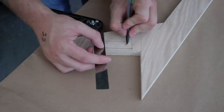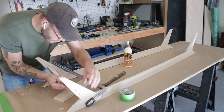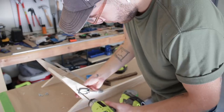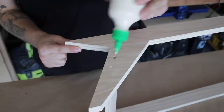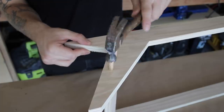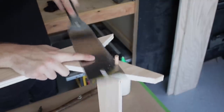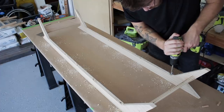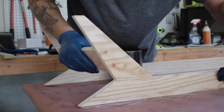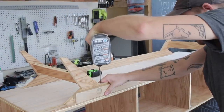I really liked the look of having visible dowels in the cabinet, so I decided to extend that into the base as well. I cut short stretchers that I used to attach my two leg assemblies together and I used glue and screws just like before. I don't want any visible fasteners coming from the inside of the cabinet, so I'm going to be drilling through the bottom of the base and into the body of the case — that's why you see me drilling these recesses on the bottom of the base. From there I could apply a coat of stain so that everything matched, and then finally install the base onto the bottom of the cabinet. There's about a three-quarter inch reveal on each side of my base, and you can see me using a quick spacer block to make sure that everything stayed consistent.